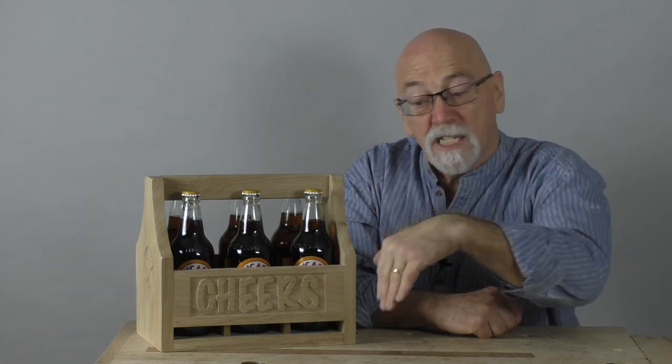Now the thing about raised lettering is that there are many different fonts and different alphabets you can use, over and above incised lettering. Incised lettering — where you cut into the wood — usually means a font that's very particular in the way it carves. It carves very well and quickly. When it gets into complicated fonts with round bits, it's actually quite difficult and doesn't satisfy very much. But when you're doing raised lettering you can have any shape you like. It doesn't actually have to be a letter — it could be a leaf or anything — because the setting in of the letter is the same as what we would do as woodcarvers for any low relief carving.